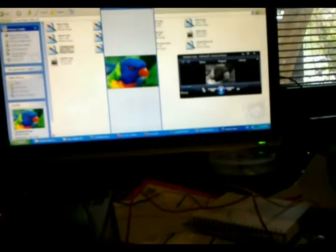Anyways, I have done a pre-recording of the animated picture in action on my Sony HVC-3000 Trinicon tube camera to bring out a better color picture on the screen. At the moment, I've just got the black and white flickery image. But I've done this in order to get a more accurate looking view of how it actually looks to the eye, as opposed to on my digital camera, because the Vidicon tubes have after image persistence. So now we'll switch over to that recording and you'll see how it actually looks.